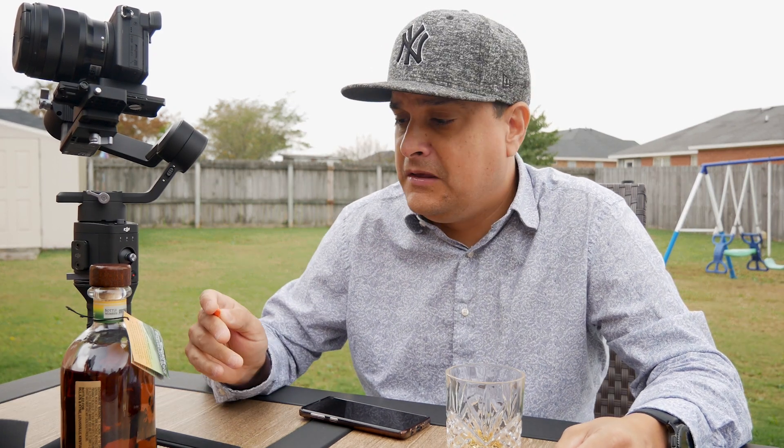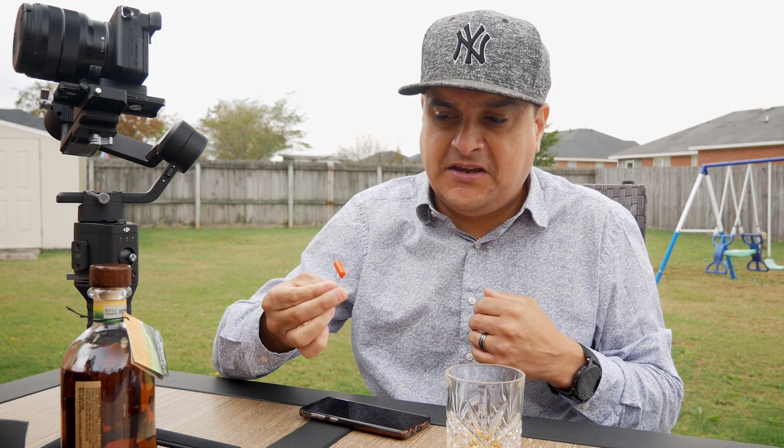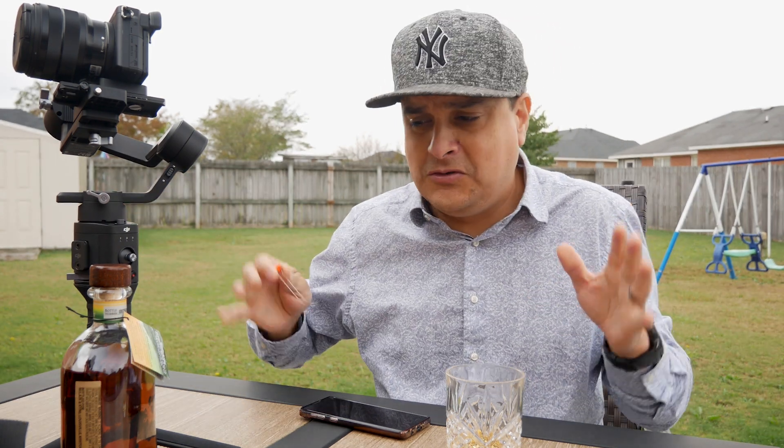Now what does the letter mean? The letter — 'J' in this case — is the tolerance. Starting from A going up to Z, A is the tightest tolerance, around 0.01% — you'll never see that in a guitar, it's very expensive. J falls in at 5%, K falls in at 10%. The capacitors we stock here at Dylan Talks Tone and sell on our website, we never go above 5% tolerance. I always look for J and below so I can have a good quality cap and not worry about it drifting, as long as it's not old. All old capacitors drift to some extent — that's a different video.